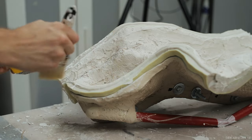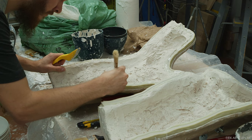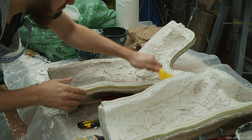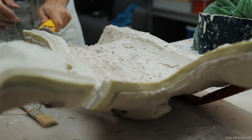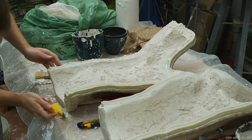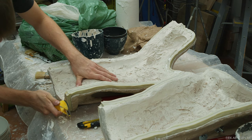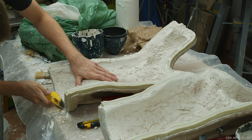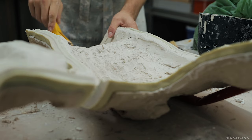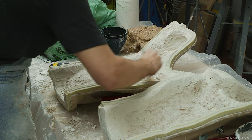One important note about these open silicone edge molds: the silicone edge can be squeezed and deformed if you strap the bungee cords too tightly together. You want them to be tight, of course, but not so tight that it deforms where the two halves of the mold meet. Now, if you were doing a closed edge mold — where the edges of the mother mold touch each other instead of the silicone edges — you wouldn't have to worry about this, as the hard shell obviously can't be deformed. I prefer the open-edged mold seen here, as it allows me to properly inspect whether the silicone of the two halves has registered together properly — you cannot see this if the silicone edges are hidden behind the mother mold.